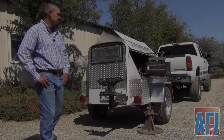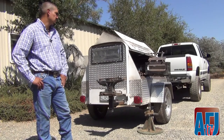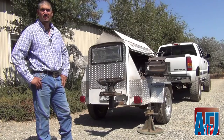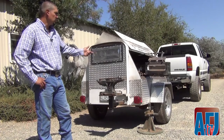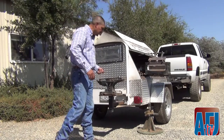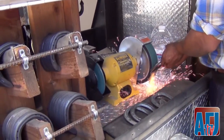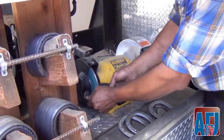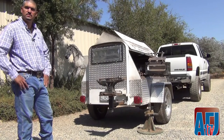One of the things I wanted was to keep it simple because we have limited space to work with — it had to be completely functional. The obvious place for the forge is as close to the anvil as possible, so I used a swing-out arm for the forge at the back of the trailer. When it swings out it's right next to the anvil so I can bring shoes straight to it. For the grinder, mounting it to the back takes up less space. I put an expander wheel and a heel-check wheel on it, and that grinder does the job.